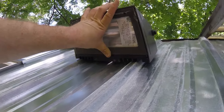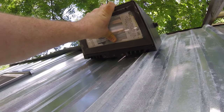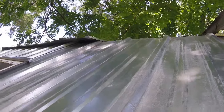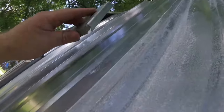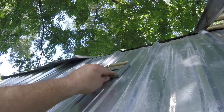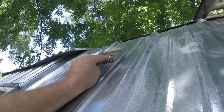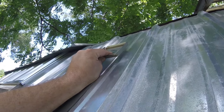I need to take care of the gap between where it mounts. I'll probably put a piece of plastic or treated wood there and put some caulking around where it attaches. This is the mounting plate that will mount right there, and the piece of wood is behind it. That treated piece of wood will bring it about right here. I'll screw it through to the other side and mount this thing on. I'll have to drill a hole in the middle for the wiring to go through.